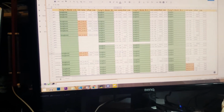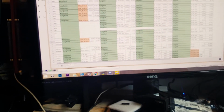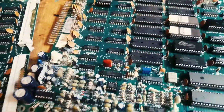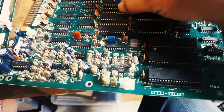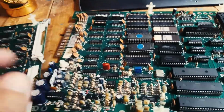3EA. So okay, anyway, what this tells me is that in this case it goes on the A board and at location 3E. So this is the A board, and location 3E goes here. So this is the top one, so fair enough. So my camera just died. The dilemma here is I wasn't sure if 1 went here or here, but it actually goes here, which is fair to assume that 2 goes here and 3 will go here. So I can actually now use these knowing that the sound ROMs will work.